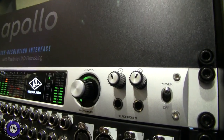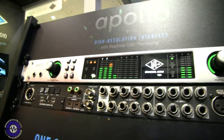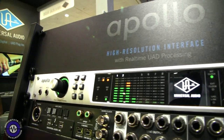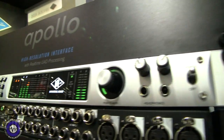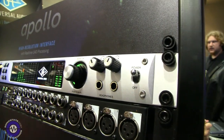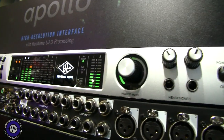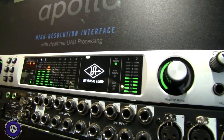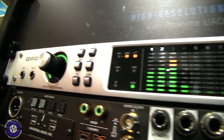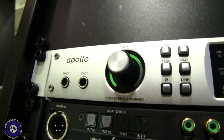We went through a lot of painstaking development to make sure that it was the most beautiful front panel that anyone's ever made. It's a piece of custom extruded aluminum. It goes through about 150 post-op processes through the punching, through the milling. To finish out the look and feel, it's bead blast so that you get rid of any imperfections. And then it's anodized, so it gets this beautiful finish. There's no paint on this product. What you're seeing with the Sparkle machine is just through the processes that we do to manufacture it.